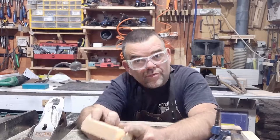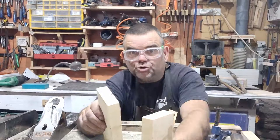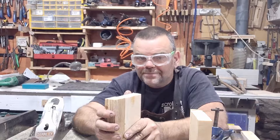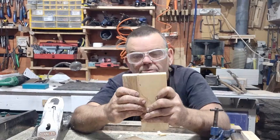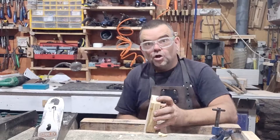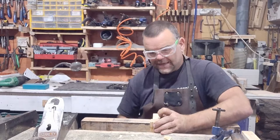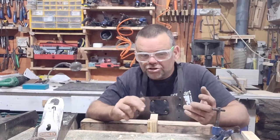What you can do is, if you want to plane a piece of wood, you can use a piece of sacrificial timber. All you do is put it in the vise with the sacrificial timber behind it. With that piece of wood squeezed up behind it, you won't get that breakout — or if you do, it will be a very, very tiny amount. Lower the vice, but not so low that you catch your fingers. That sacrificial piece is pretty much in line — if it's about half a mil down, it'll still do its job, because it'll be supporting the back edge.